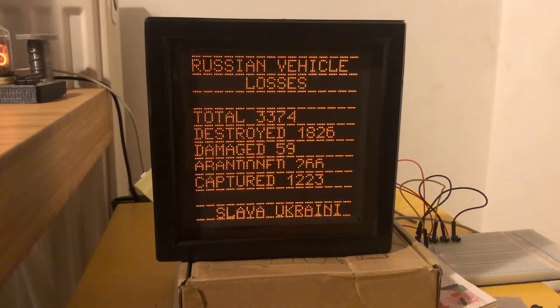Actually getting the display to show text from a web page is not as difficult as you might think, partially because somebody else has already written the code to put text on the display using Arduino - there's a link in the description to the GitHub page. This display in its current form is designed solely to display text, which makes life easier. All I had to do was connect up a suitable microcontroller and use this existing library. I used an ESP32 because it has built-in Wi-Fi, and it goes via a shift register. The wiring diagram for connecting to the existing connector is also provided at the GitHub page.